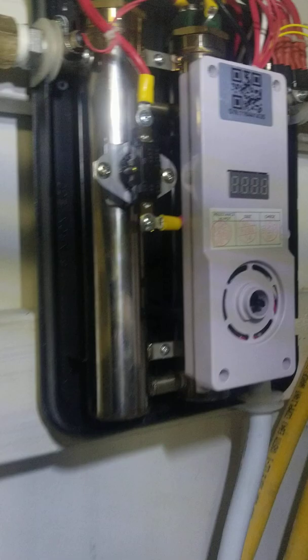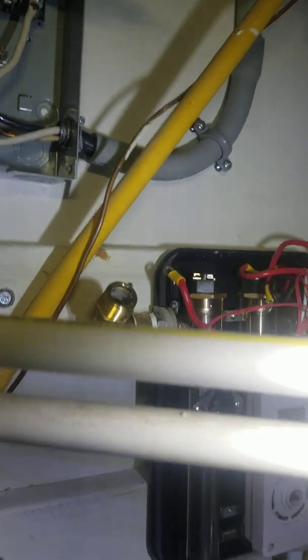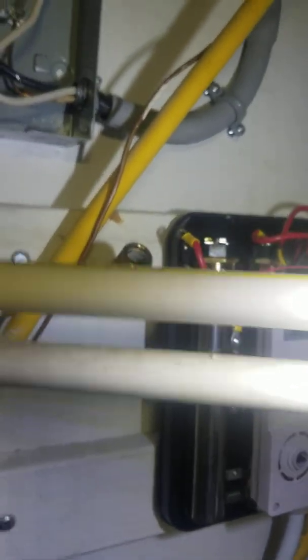Most of what I'm seeing says to take out the two elements — turn off your water, drain the water so you don't have a lot of mess. I've disconnected the flexible lines here you see hanging out. I put this unit in series with my hot water tank, my existing gas-fired tank, and put it in after it.